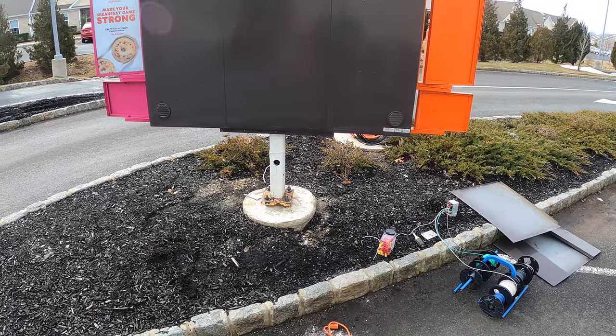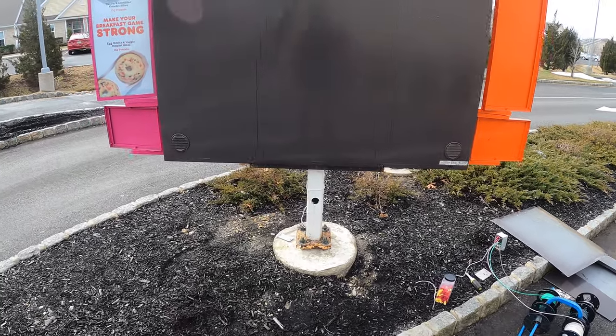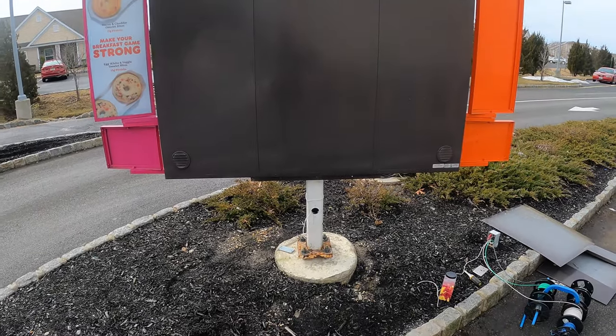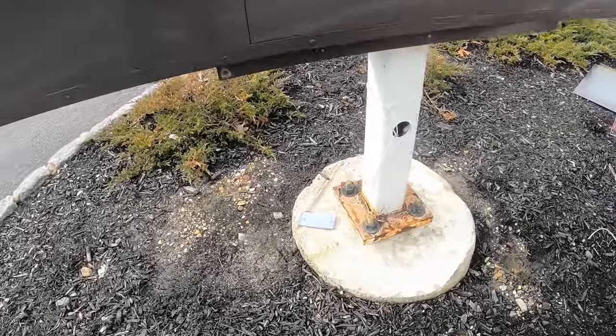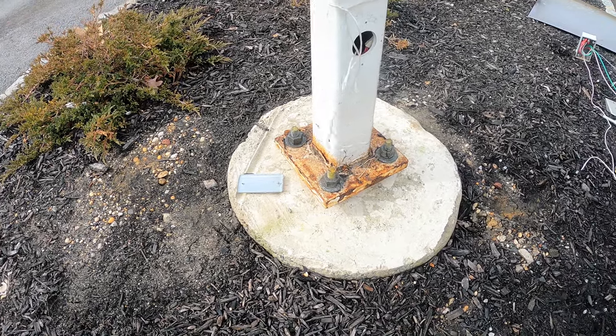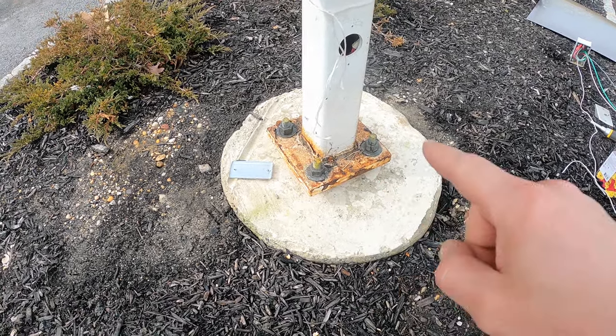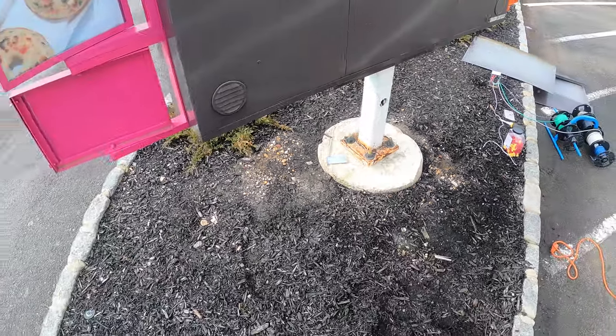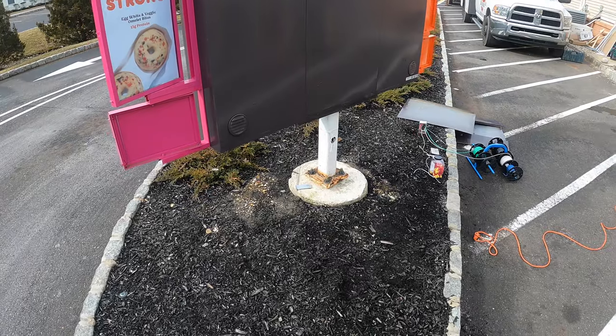We're getting ready to get this sign strapped up. I'm gonna use the Bobcat and we're gonna pick it up off of this footer. Then we gotta grind off these studs here and put in new anchor bolts, because these bolts are 6-inch on center. The new sign is 8-inch on center. Anyways, let's get started.